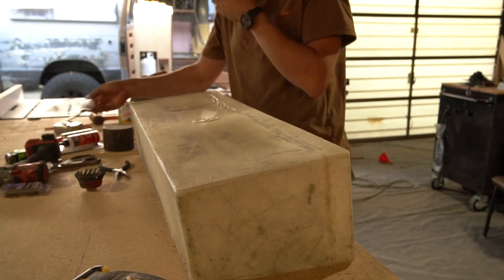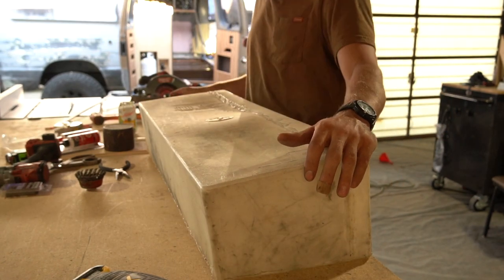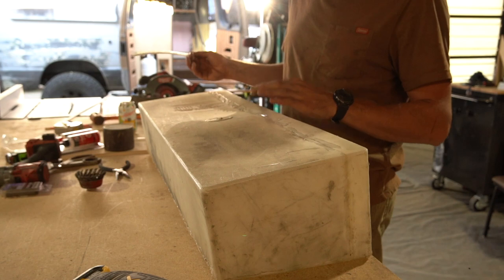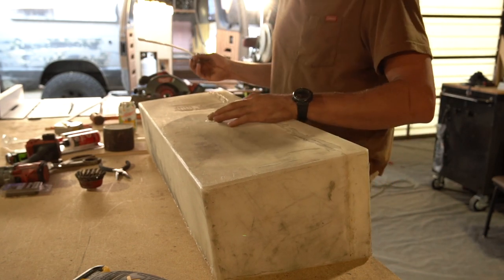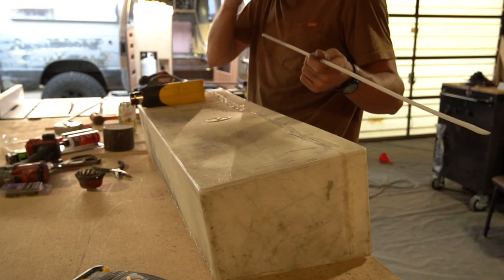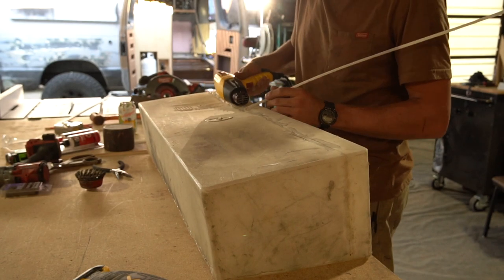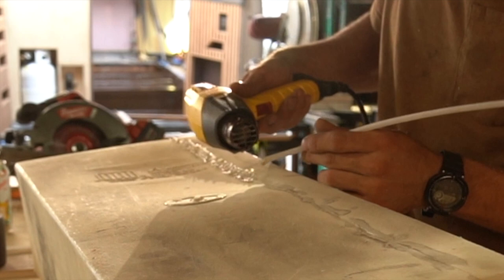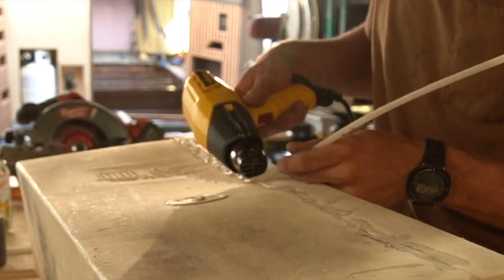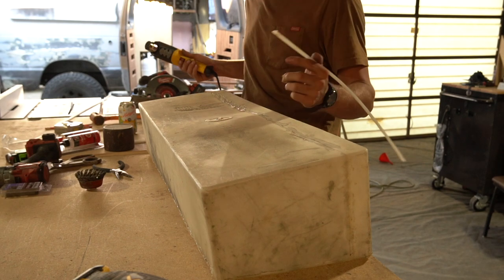I think I came up with a pretty good technique. If you were to do this with a tank, you would need to cut some strips off or buy strips of the exact same plastic — this is just a freshwater tank from RecPro or something similar. This is a way to do it without a plastic welder: heat it up and run the filler along like this, heating both the filler and the material as you walk along, pushing it in. You can see the ribs it makes — you can sand that down afterwards.